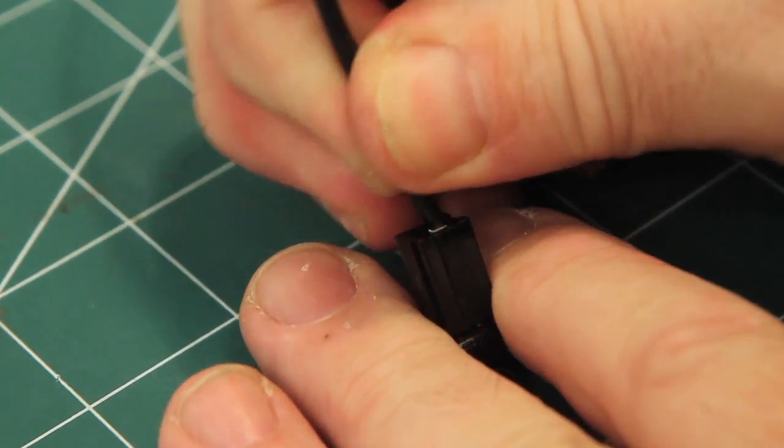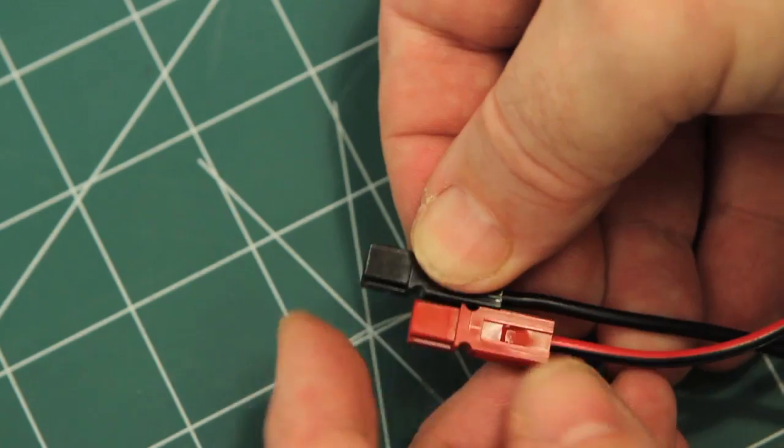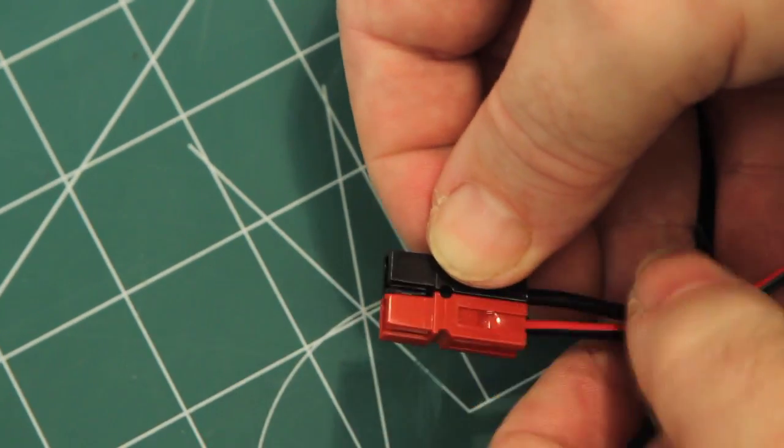After the click, the tool can be opened and the finished contact is properly crimped into place. Insert the contact into the connector body and firmly press it into place. To make the finished connector, simply slip the black and red halves together.